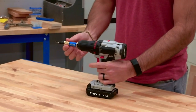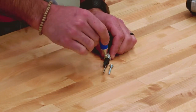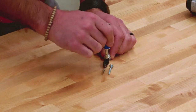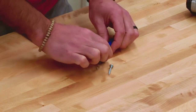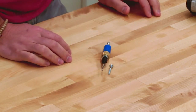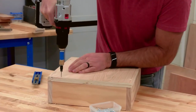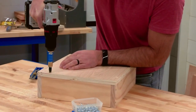On one end, there's a drill bit that's sized to drill a perfect pilot hole for a Kreg screw, plus a cutter that drills a flat bottom recess called a counterbore that the screw head fits into. A hex wrench built into the Quick Flip makes it easy to adjust the bit's drilling depth to perfectly match the length of the screw, making it easy to drill the pilot hole and counterbore in one step.